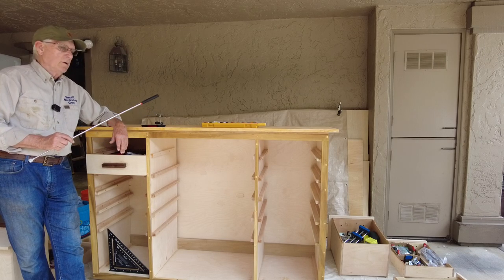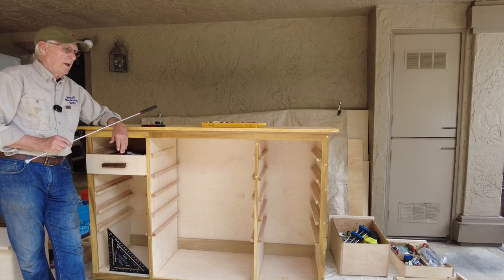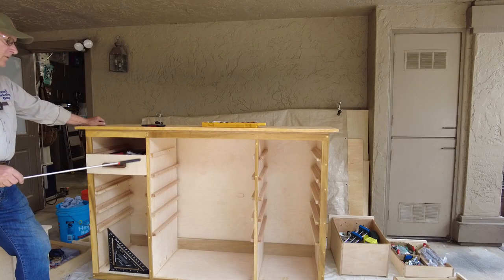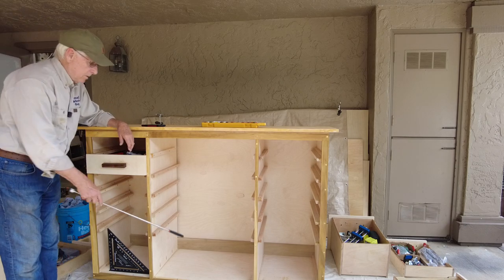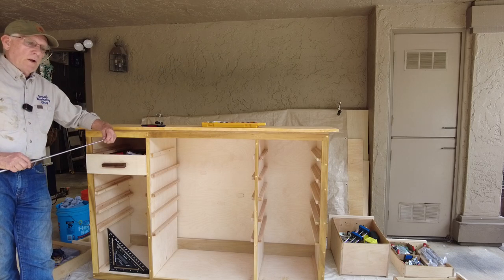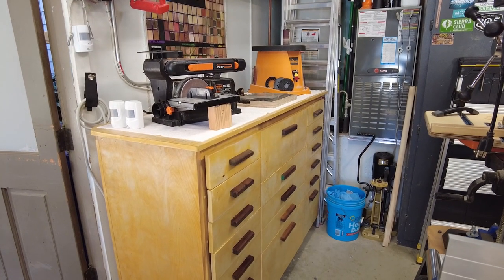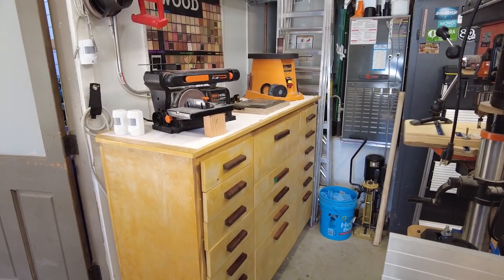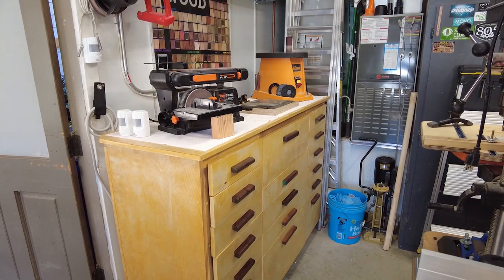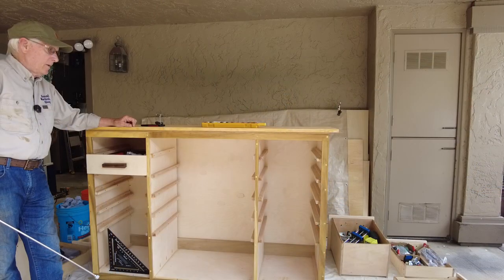So I picked the finish I thought looked best and poured the Watco finish right on the top. The minute I did that I said, 'Oh, that's a mistake.' I like how it brings out the grain, but I don't like that amber color. I really should have tested it somewhere — on the inside or the back — before committing to the whole top. I sanded it all off and then put on some shellac, and it really came out cool. It's kind of an artistic, textured effect — like those fancy walls you see in high-end homes.